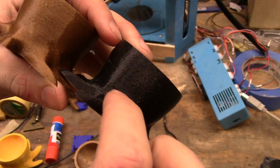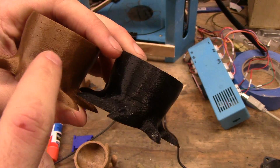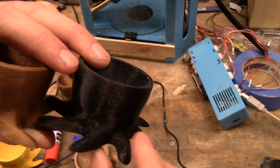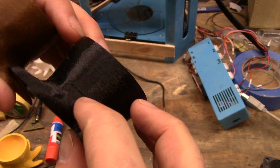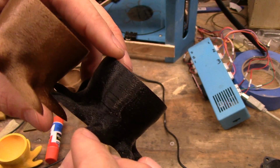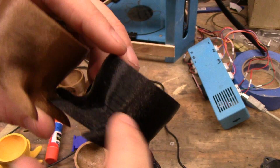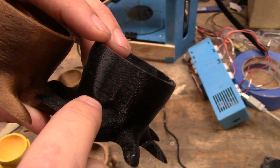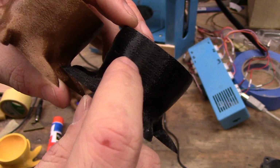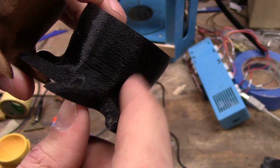Yes, I see a number of structural issues. I'm looking for structural issues, not extrusion or filament issues, because obviously they're not the same filament. I can't do exact one-to-one prints for comparison purposes. But I'm seeing a lot of layering issues where I can see a crack here, crack there, crack there, crack there. I'm seeing all those in shifts where they don't quite line up right.